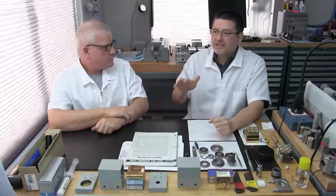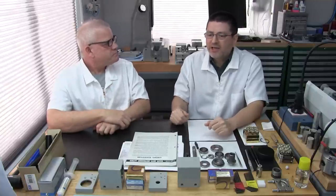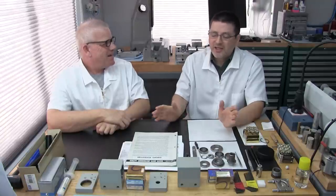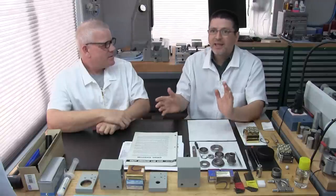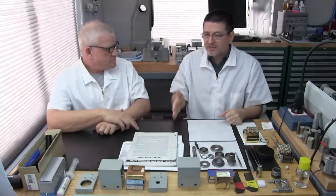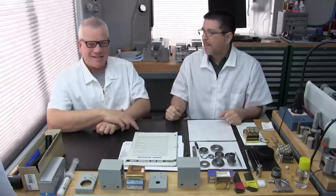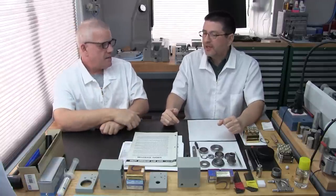So he tried to rebuild the spindle. We knew nothing about it at the time. He took it apart and looked at it, because he has some knowledge. He contacted Levin, and Levin told him, you can't. That uses a special flange style angular contact bearing that no longer exists, and hasn't existed for years. We can't find the bearings anymore, so we can't rebuild this headstock type. Your only choice is to buy a new headstock. It sounds like a sales pitch, but when you dig into it, it's actually a true statement from them. That's right.